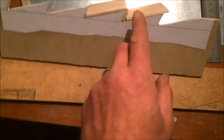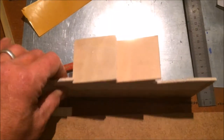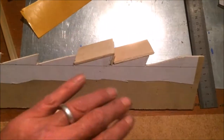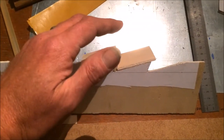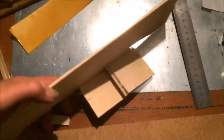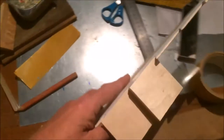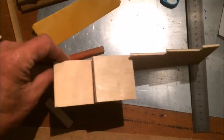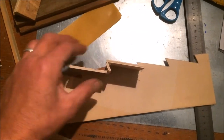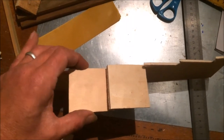I've got to find the right length to cut my strips — that will be my mould. I've got to fiberglass the outside so that the inside comes out nice. The inside doesn't matter as much, but I've got to sort of build it from inside out and flip it over.